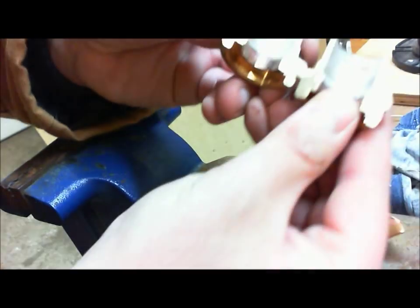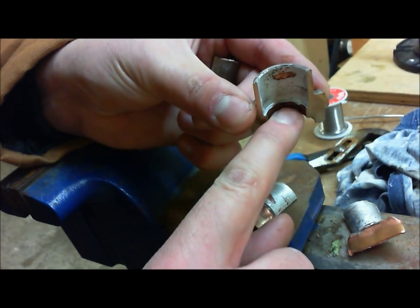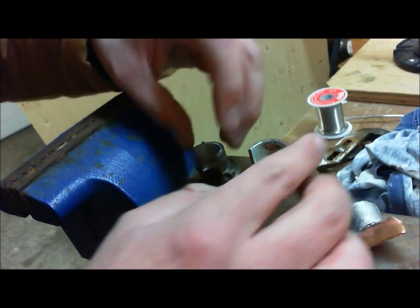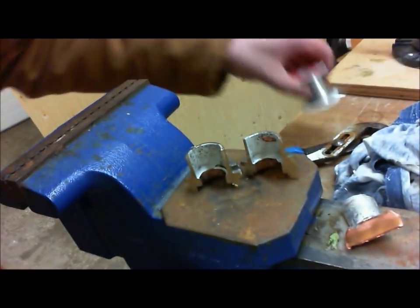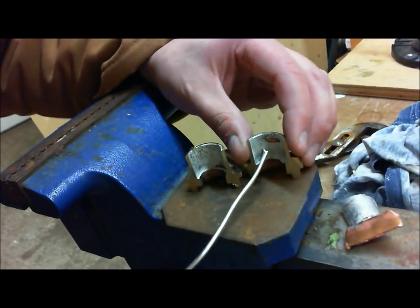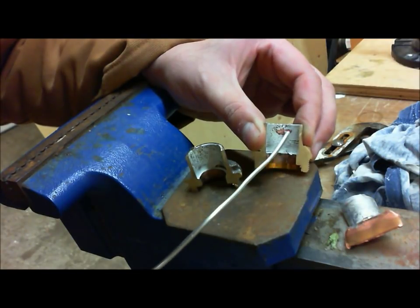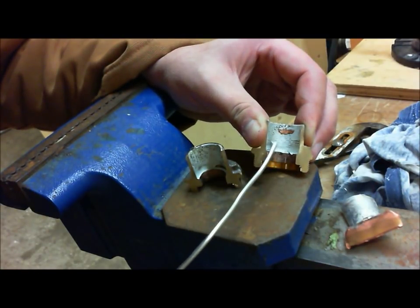All right, but this is considered a waterproof joint. Not a perfect joint, but it does mean I've got solder all the way down to where the water's starting. All right, in both cases, I do have solder. Okay, all the way down here, I do have solder, so that's very good. On this piece here, I don't have enough solder, so that would mean there's not enough heat, right? Or possibly flux came out, but generally the heat is the issue with this. But again, all solder. There's not any bare copper spots anywhere.